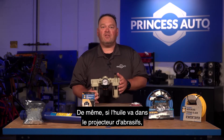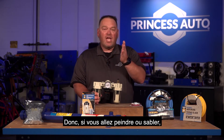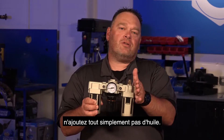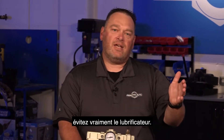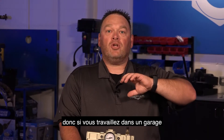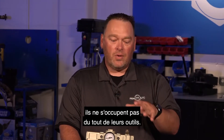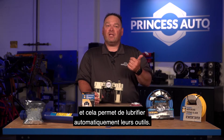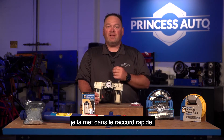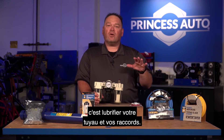If you're going to paint or sandblast, it's really not suggested to use a lubricator. If you add oil to the air that goes through your paint gun, you'll have oily paint, which won't leave a good finish. Likewise, if oil goes into the abrasive blast, it can clump the media and cause clogging issues. If you buy the FRL as a kit, just don't add the oil. If buying individually, stay away from the lubricator. In a shop application where guys are using different tools and not doing any maintenance, you can add the lubricator in-line and it will automatically lubricate their tools. Personally, I just drop a little oil into the quick coupler to lubricate my tools that way. Your hose and fittings don't need lubrication.